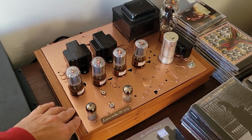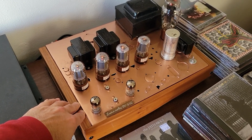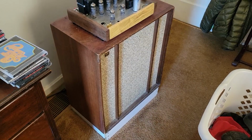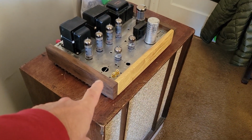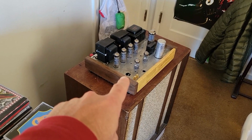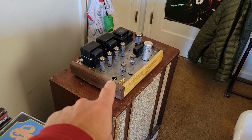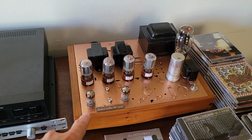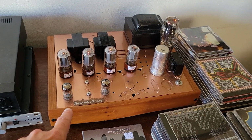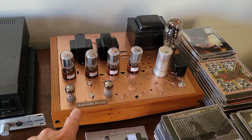You know, where you're really going to start noticing a difference is once it's really cranked to full power. And I really can't do that on these speakers yet. They need a little work. I haven't actually measured the sensitivity for this. It should be, according to the design, 2 volts. Design full power is 10 watts per channel. I think this one can give me 12 watts, whereas this one maxes out at about 10 watts. I measured it, I think 1.9 or 1.91 or maybe 1.95 volt sensitivity for full power.